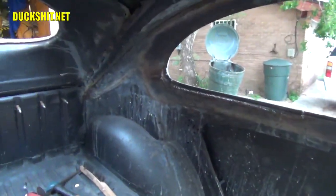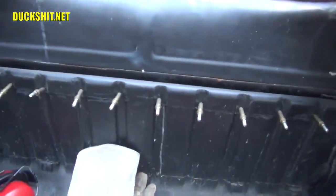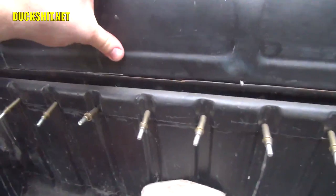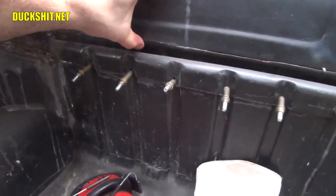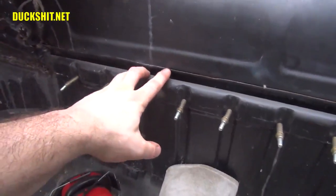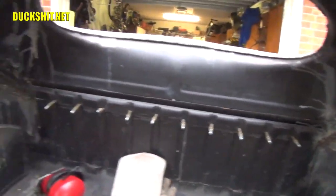Whatever was going on with the rain, it seems to have been to the west and to the north — I just managed to catch a whiff of it. The temperature drop was a huge difference though — it was about 94 and I'd say it's about 79 now. What I've been doing is using my body saw, which now needs a blade replacement. I've been cutting between these two layers because I just realized I didn't weld this gap in — for some reason I thought that was just a factory seam, but it's actually just a gap I didn't weld. I've begun cutting along this line using the body cutter, and you can tell the seam is perfect — these two pieces line up absolutely perfect. One piece is overlapping the other and I'm cutting through just the one using the other piece as a guide, running right along that. I've got a perfect seam over here to weld shut and I'm going to continue cutting and then try to weld that seam in also.